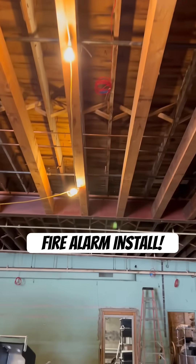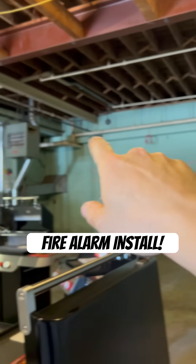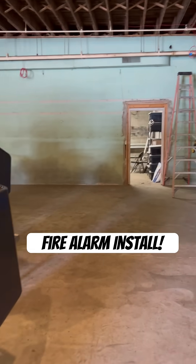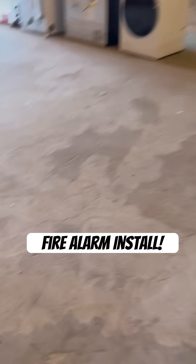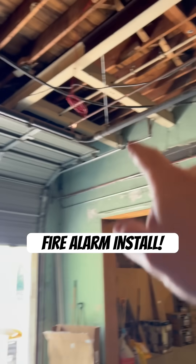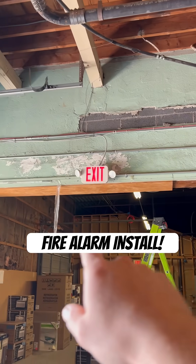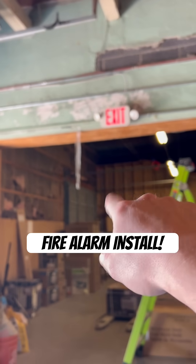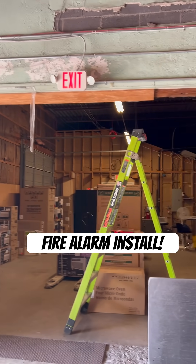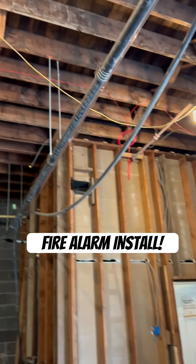Here's basically just a little overview of what I got — I'm probably at the halfway point. There are some smoke detectors over there, there's going to be a smoke detector in that electrical room which is going to be a general storage room. Above that garage door there's also a smoke detector. And in this room I'm going to be adding an outdoor strobe, which is required on this plan. That's going to be signaling so in case the fire alarm goes off, the fire department comes and they can see that outdoor strobe.